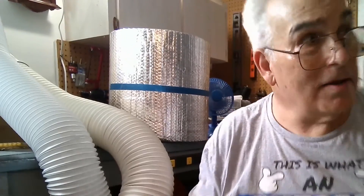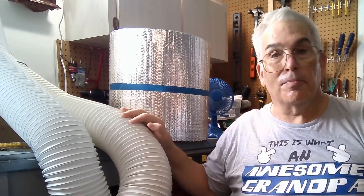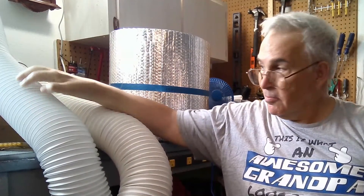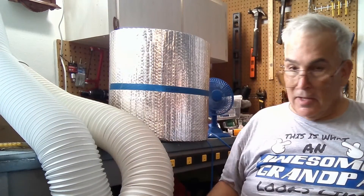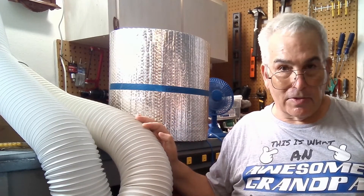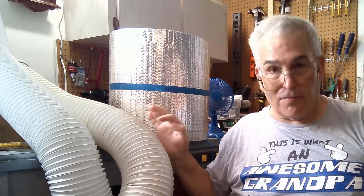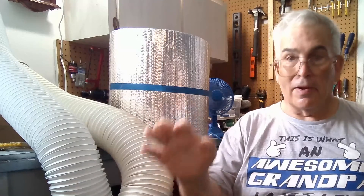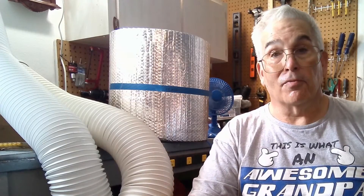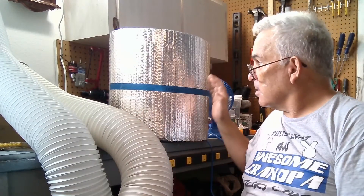The negative side of all this is that these tubes are not insulated. Because they're not insulated, while you're pulling fresh air in from outside, the exhaust temperature in the tube can reach over 120 degrees. That heat transfers from the uninsulated tube back into the room, so your air conditioner ends up working twice as hard to overcome both the room heat and the heat coming off that tube.